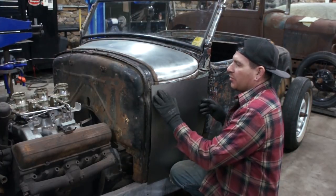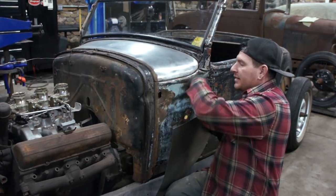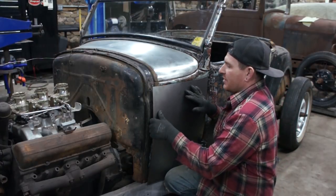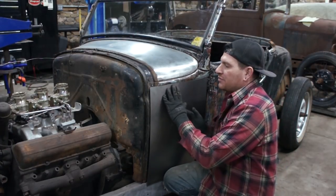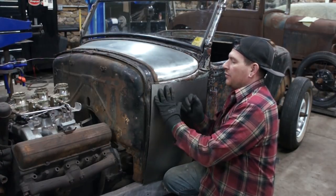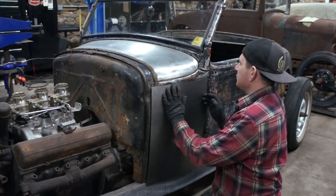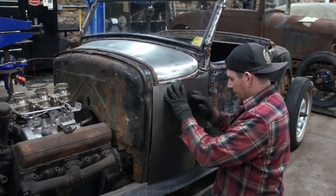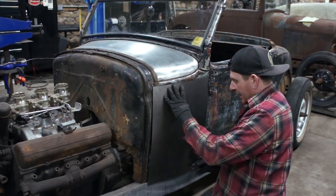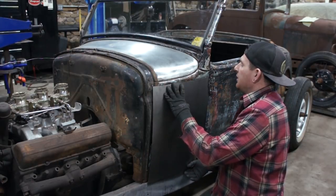here to get it to pull in at the top here, and you can see on the car, it dives in right here. So we need to help that happen with our hands. And form can be easily reversed by just pushing it back with your hands if you go a little far. So we got a little bit of a dive in there. Just doing that little bit got us close there. And then by twisting it at the bottom, I'm not hanging off too much. If anything, it's just touching the frame here because there's too much material, and that's what's holding it up.